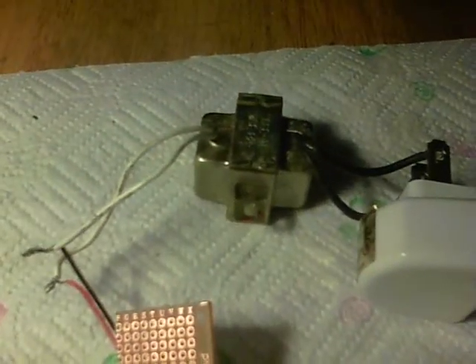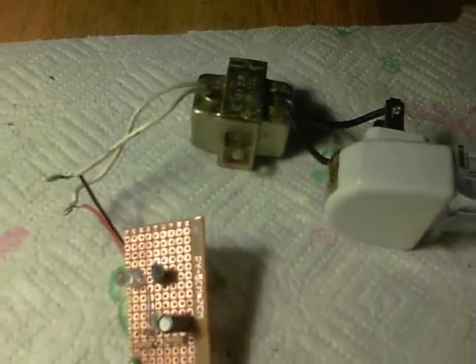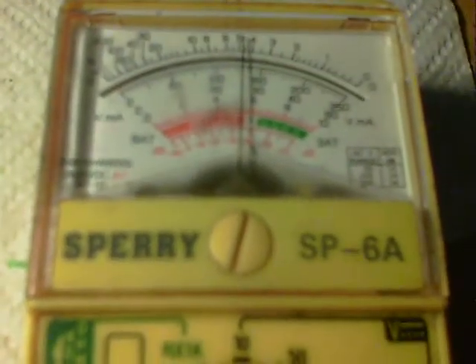Here is an LED nightlight — 0.4 watts — and I've got a small transformer attached to the ends. I don't know where it came from; it came out of a junk box. If I connect it up — there we go — you can see it's using around 125 to 130 milliamps, so at 3.9 volts that's half a watt. For a 0.4 watt LED light, it's not bad going, and there we are with the light on.